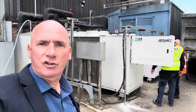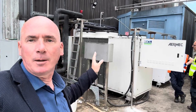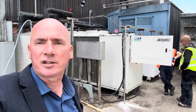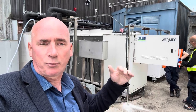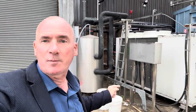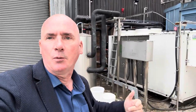We slightly changed the design, because they just had one chiller feeding the ring main to jacketed vessels inside. Tony's given me permission to record inside in a minute. So we did a redesign for Tony, and showed him how we could connect both chillers on a primary flow and return header. We have a hydronic separator here, which Tony made up himself, because they make tanks themselves. And then we have a pump station just beyond that, which we supplied.